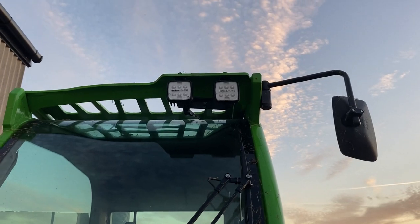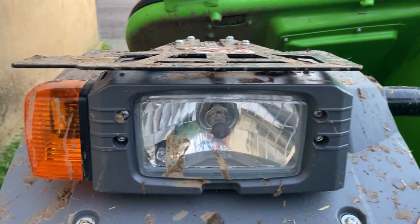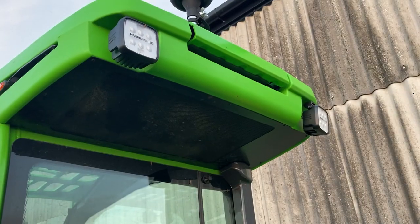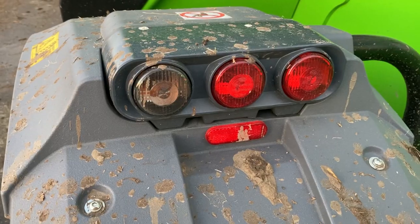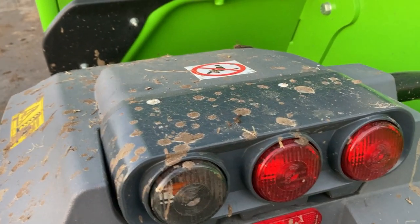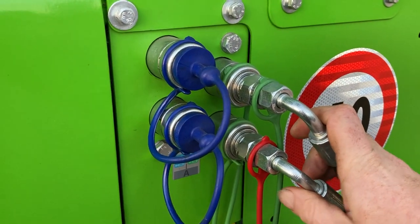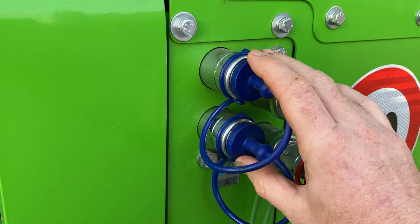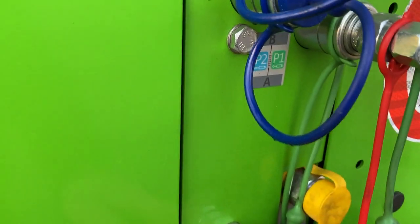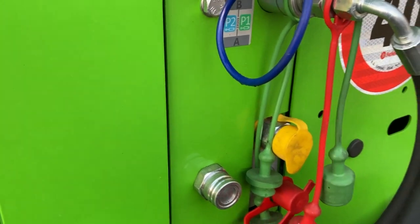A good idea. There are two LED lights up at the top of the cab. The work lights on the boom are normal halogen bulbs, and then we've got LED lights at the top of the back, and it's got an LED flasher as well. These are the lights on top of the mudguard - it hasn't got a reversing light. That one is the indicator, and I think these are the brake lights and side lights. Here you've got the hitch where you can plug in a double-acting trailer connection, and here's the lighting socket and the two brake lines.